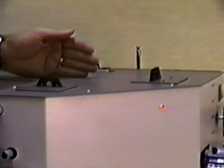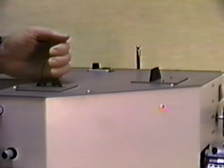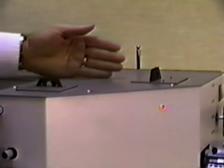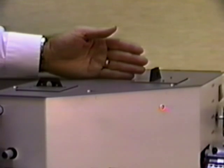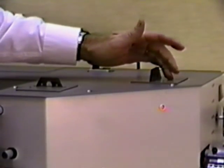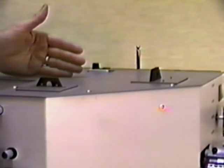The collimated light arrives at the beam splitter. A portion is reflected to the reference arm, and the rest passes through the beam splitter into the test arm, then through the filter to the return mirror. The light from both arms recombines and interference takes place at the beam splitter.